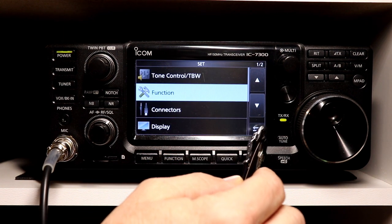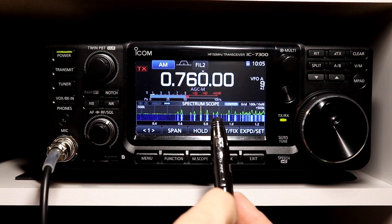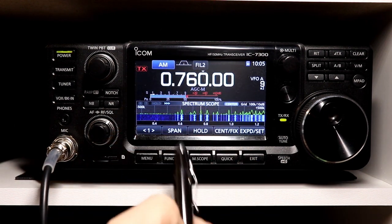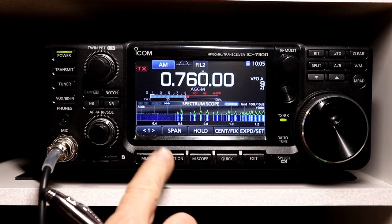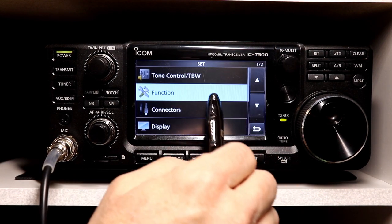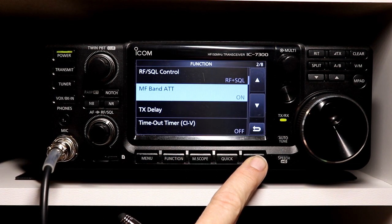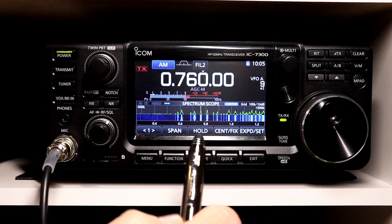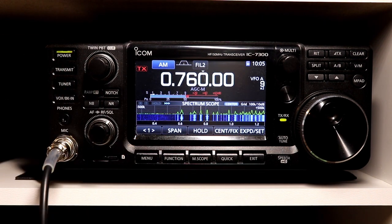So I've got it set to on right now, and you can see on the scope here a pretty noticeable difference in the signals. I've actually got a couple of scope screenshots from the rig that we'll take a look at more closely in a minute. That's really all there is to the function — just on and off. I had it off to start; I'm going to leave it on as that is the default. According to the manual, it provides about 16 dB of attenuation, and we'll go take a look at these scope shots and see how that lines up with what it shows on the scope.